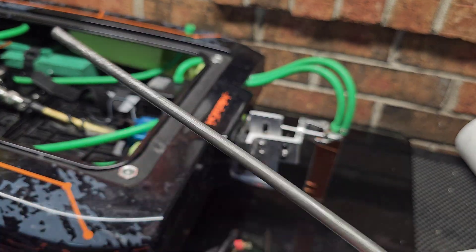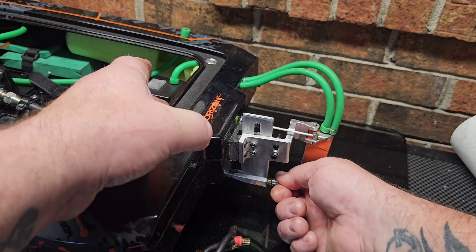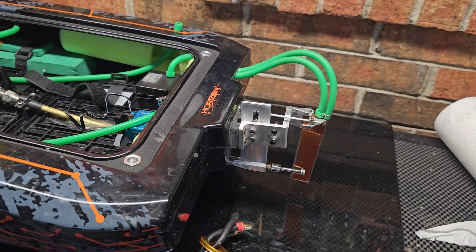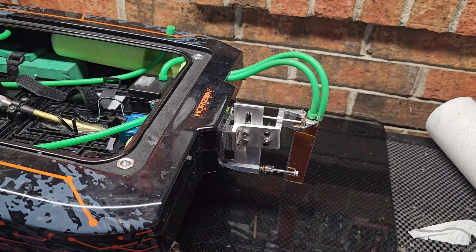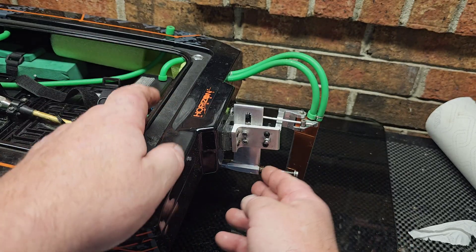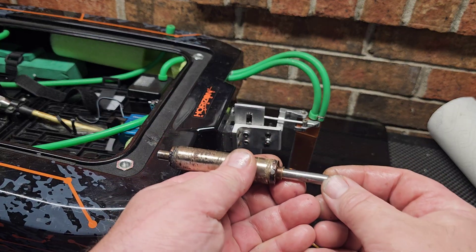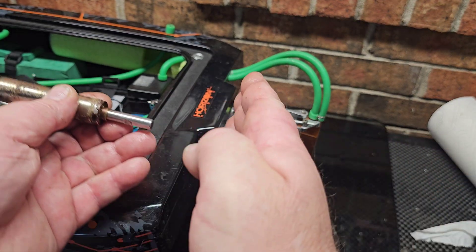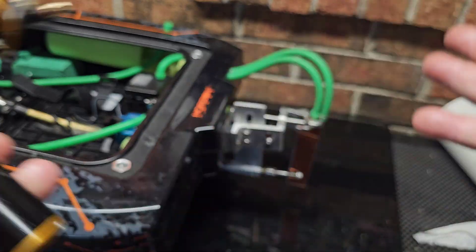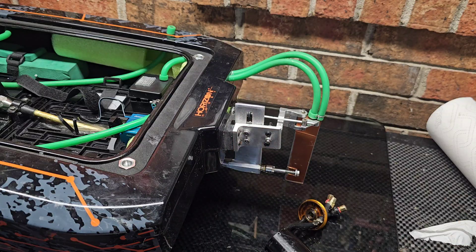It all makes sense now. With this particular motor I have a larger gap because this motor has a longer shaft. With the other motor the shaft was shorter. When that wide spacer exploded, basically the gap was gone — the motor shaft and the flex cable all got jammed forward onto the end bell. The internal motor bushing exploded during the process, and domino effect. It couldn't have happened because of improper gap — I had proper gap — so it had to have been the motor bushing exploding and everything getting crammed forward that smoked the motor.